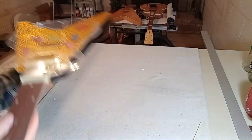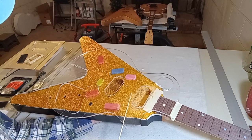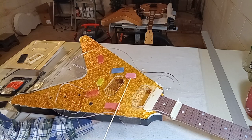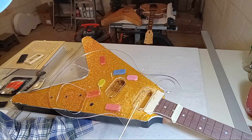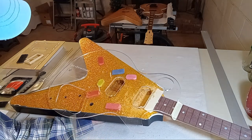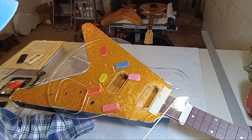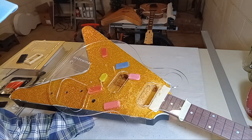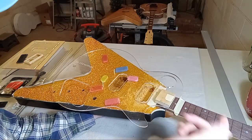I'm firing up the camera briefly to show what I was talking about. These little erasers will probably start sliding since they're not fastened, so make certain that if you're doing any machine work, nothing can move, vibrate, or slide into your work — or you'll get a violent surprise. I'm doing this on a drill press at about 3,400 RPMs. I really just wanted to use the erasers to get everything lined up, put tape at the end of the fretboard, tape along the template, then jet glue it down.